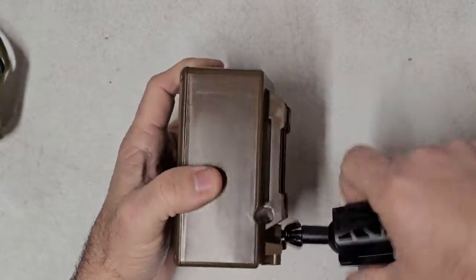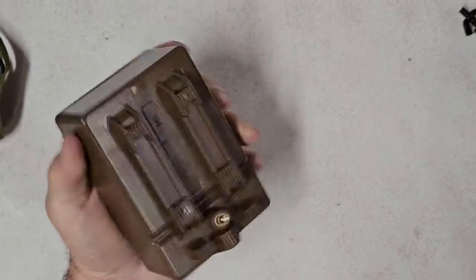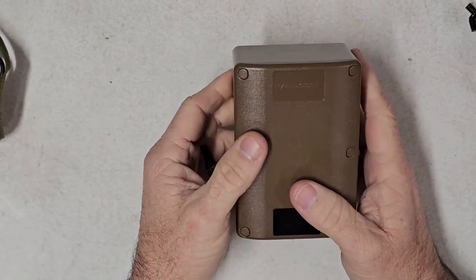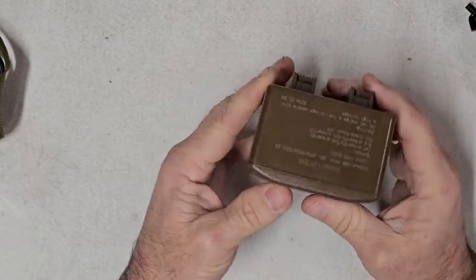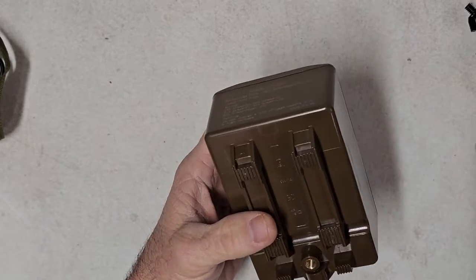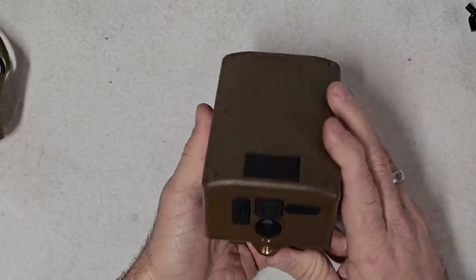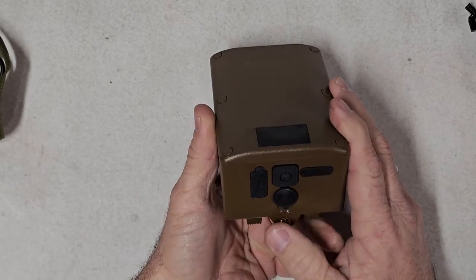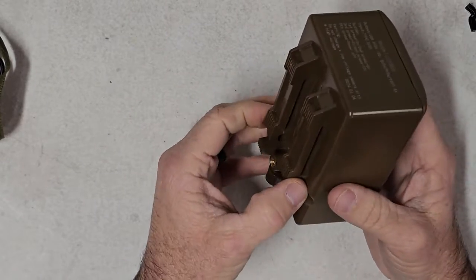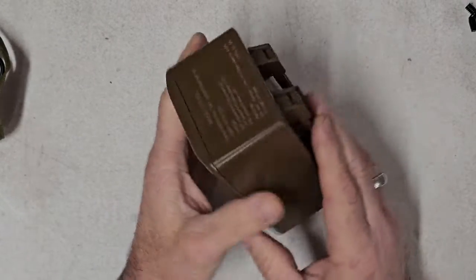All right, so let's see, 33 amp hours at 3.7 volts. I want to point something out, guys. This is not going to last like a 30 amp hour 12 volt outdoors battery. That's a much larger, beefier, heavier battery, and it's 30 amp hours at 12 volts. This is 33 amp hours at 3.7. So the voltage is stepped up to 12, stepped up to 9, and stepped up to 6. I just don't want to mislead you, but still, man, solid little unit.